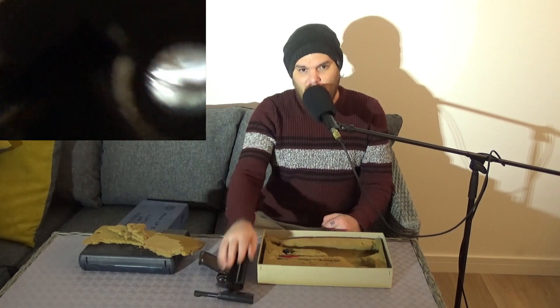The rifling is somewhat interesting — somewhat to be desired. The rifling in these old air guns is more like the factory just drew the rifling on, as opposed to it actually having a proper cut-in rifling. To be fair, air guns don't really need rifling at all — an air pellet is basically a shuttlecock, it's a dart. It's self-stabilizing, so you can literally fire it out of a smoothbore and it's pretty damn accurate.